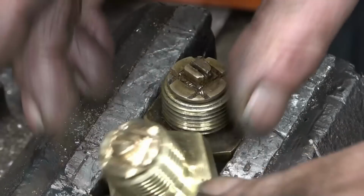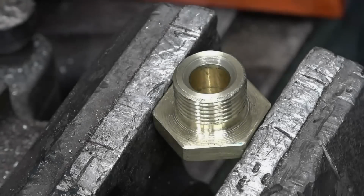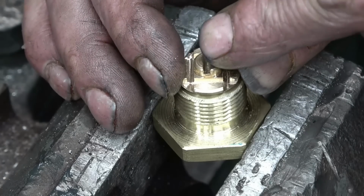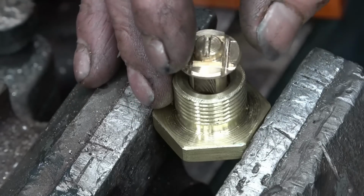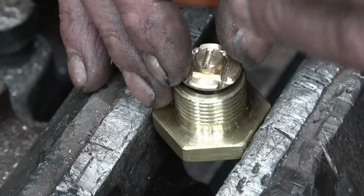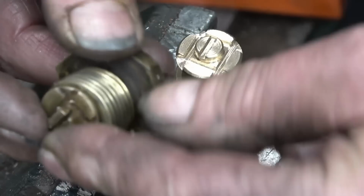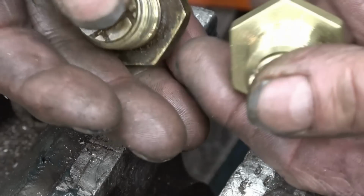So that's my version of it. The same but probably slightly different. And I found some little stainless steel springs. This should do the job. It may need shortening to take some of the weight off it. But we'll have to make sure when we screw it in that there's clearance between this and whatever stops it coming right out. That'll be governed by the thickness of washer in there. So normally it would sit something like that and the steam would bleed through there, just trickle through. Then when you press the brake, the power of the steam hits that, whacks it shut and operates the cylinder, puts a brake on. So simple, nothing to go wrong with it. Happy, very happy.